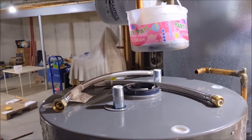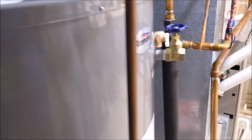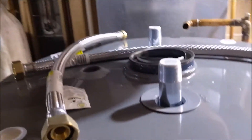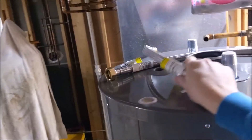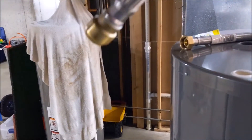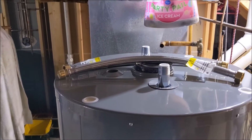After searching and talking to the people at the hardware store, we finally got success. Richmond Water Heaters, which is also Rheem — apparently this 75-gallon model, even though the manual says three-quarter inch fitting on all exterior outlets, the interior dimension is three-quarter but the top fitting is much larger. This is a one-inch fitting, as I came to find out. So I had to go one inch down to three-quarter for my copper line. I got this connector — it's got a one-inch fitting with a rubber gasket on the bottom, so no pipe tape on that one, and then a push-to-connect three-quarter for the copper. It's a 24-inch line that actually comes from the water softener section at the hardware store.